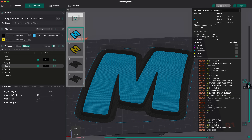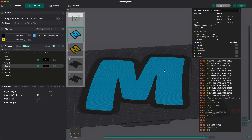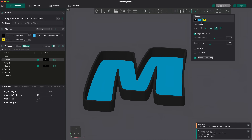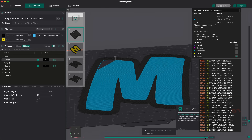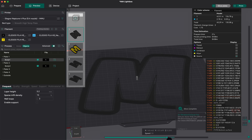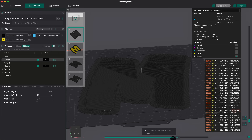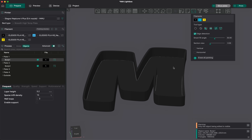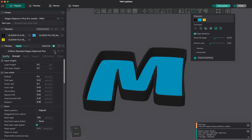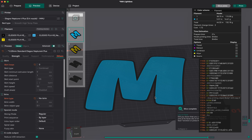What this does is change the color not only for the bottom layer but also for the inside. If I had just left it in black, the first layer would lay down fine — it would start with black and continue to blue — but then the second layer would completely cover the blue with black, and no light would shine through. I also don't want a brim or skirt on this, so I'm setting it to no brim, which leaves us with just the model itself.